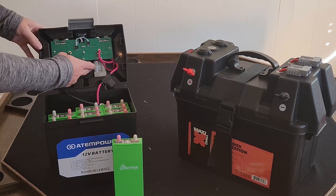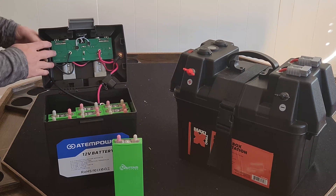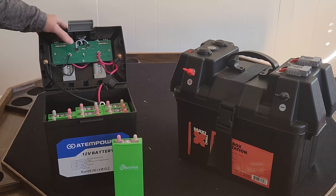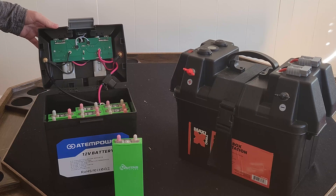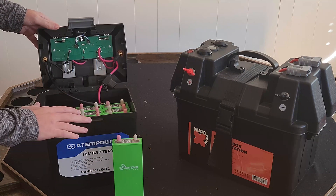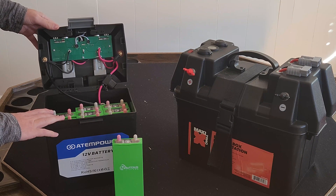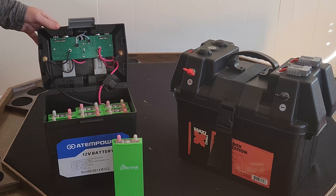All of that is activated with the push button. Here's the circuit board — it's got Anderson connectors in the back, and everything runs to the board. It has a relay, which is like a low-voltage switch that activates the heavier stuff. We're going to make a 3D printed top to hold the cells together, with bus bars that we'll CNC out of aluminum. Let's bring those into frame and then we'll build this pack.